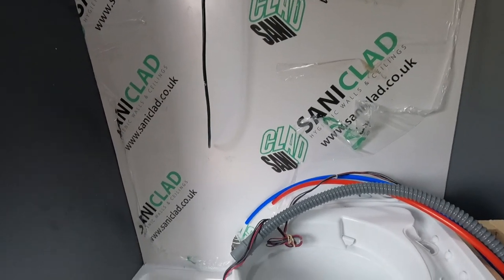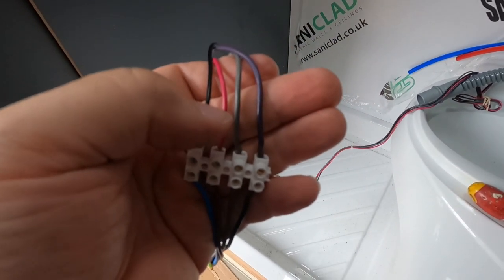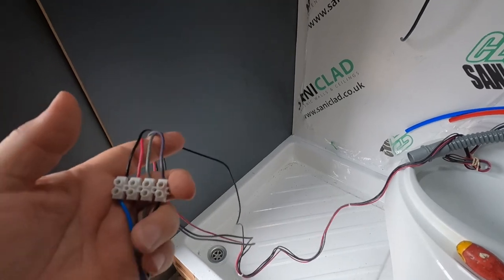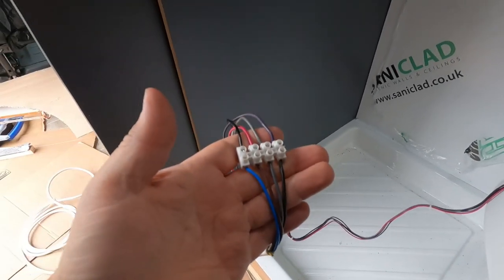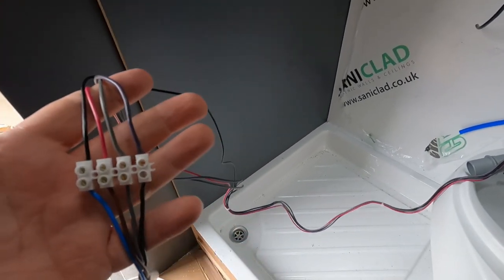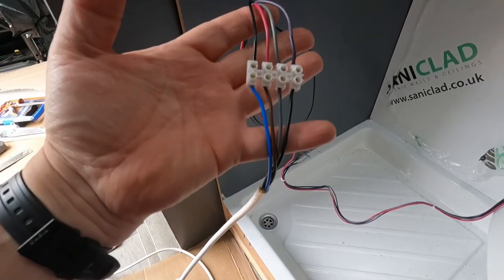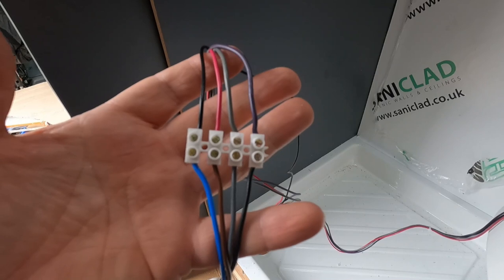Now I'm doing the electrics for the toilet. There are four cables on this Thetford toilet - black, red, grey and purple. I haven't even read the instructions yet as I want to crack on building the shower carcass. I've found a length of multicore cable left over from a completely different task and connected these wires together. I'll shove that through to where I want the cable to go and worry about the colour coding later. Before it gets buried I'll wrap some tape around the joint for waterproofing and take a photo on my phone so I know which colour I've connected to which.